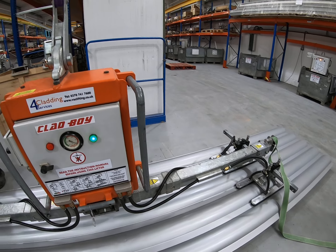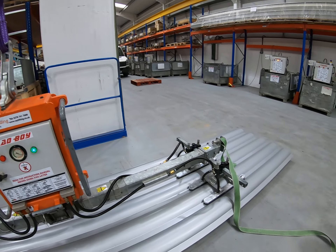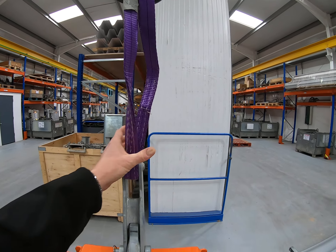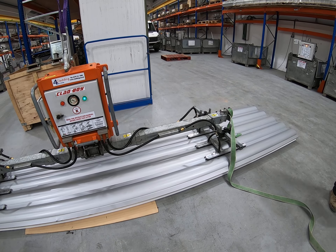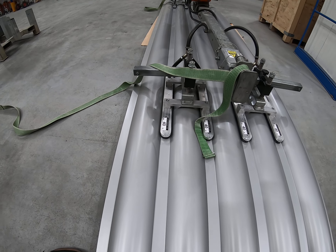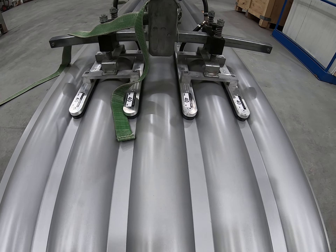When you're happy with the positioning, make sure all the weight of the machine bears down onto the panel, because that will positively locate the seals onto the panel surface. There should be no tension on the lifting drop — the machine is bearing down through all eight pads onto the panel surface. The pads are located in those valleys, in the bottom of the valleys, each side.